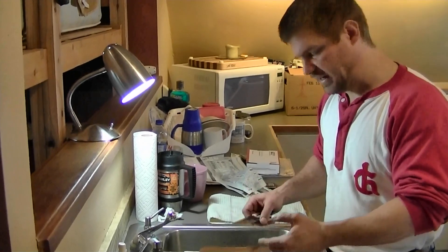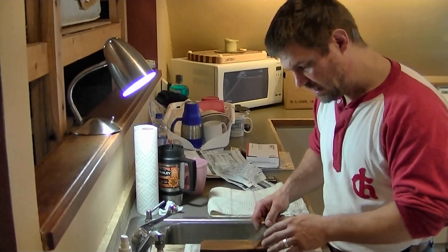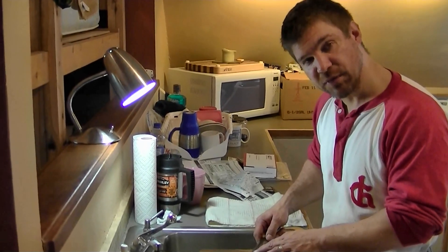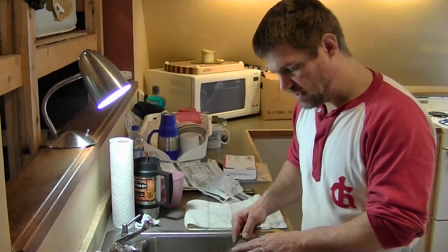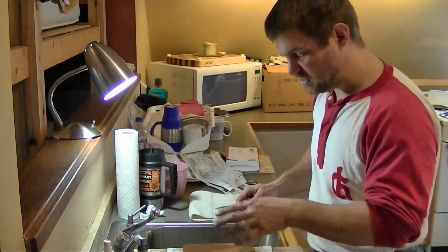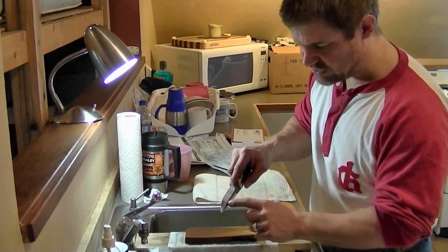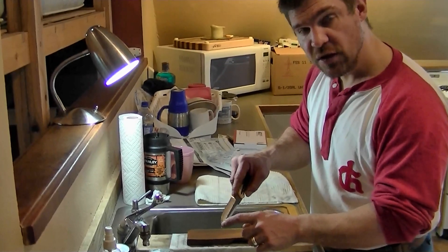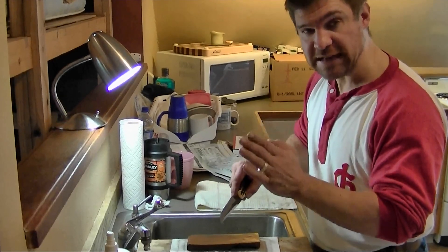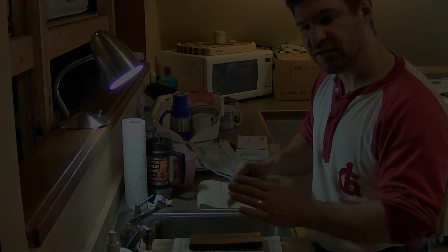When you're sharpening, if there is a little bit of rocking in your wrist — which there is for everybody — it's better to be too low and adjusted within that range, rather than adjusted perfectly but too high. That's why I always encourage my students to sharpen their primary edges at the lowest angle they feel they can do it. If my students are getting scratches on the secondary edge while attempting to sharpen the primary edge, then I say that's the right mindset and the right frame of reference. They'll get a nice convex edge, but it'll be very subtle and still very acute.